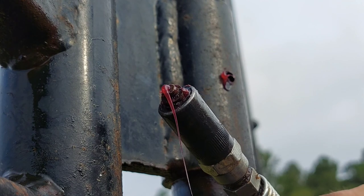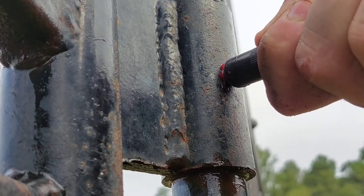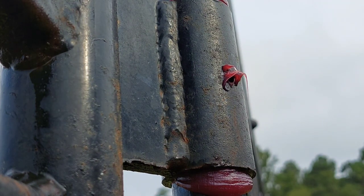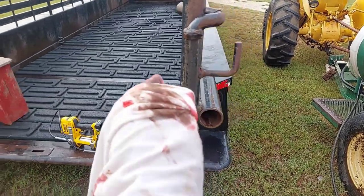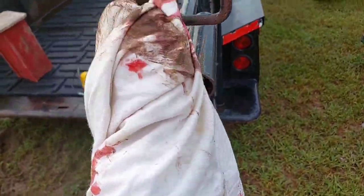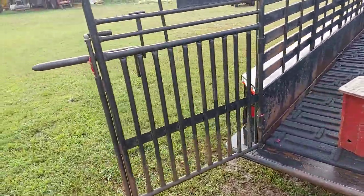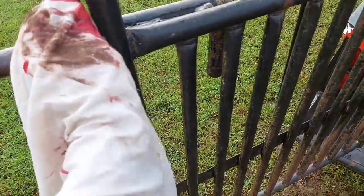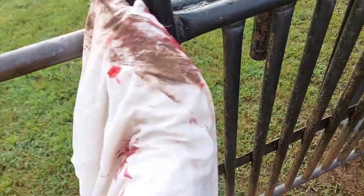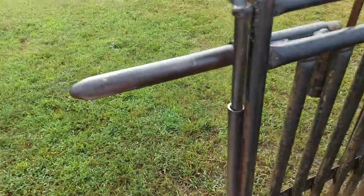Right here I have a grease zerk that's been broken off — I just stick an old grease zerk inside my grease gun, shove it in there, push a little pressure, and you can re-grease any spot even if the zerk has been broken off. Sometimes that'll get you out of a jam. I also like to take the grease rag and lightly grease all of the little rods. I don't want an overwhelming amount of grease — that gets really nasty — but if you just lightly slick it up, it'll keep it from rusting and make it easier to move. You don't want a whole bunch of nasty grease all over it, because some places you're going to want to grab hold and get it latched up.